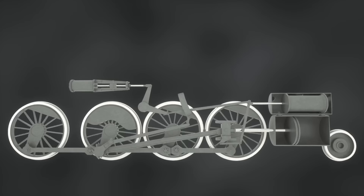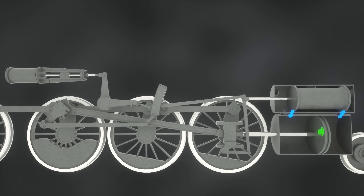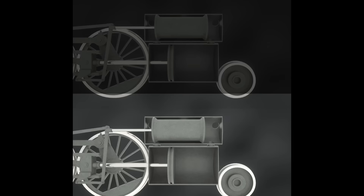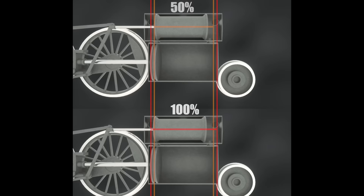The rest of the configuration is what's responsible for the correct movement of the timing valve. The valve's offset can be controlled with the Johnson bar, so that the locomotive can change direction based on which side the valve lets steam out. But it can also be set to any position in between, allowing the engineer to use less steam, as keeping a vehicle in motion requires less power than getting one started from standstill, and so the use of additional steam would have a negligible effect.